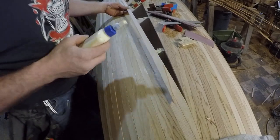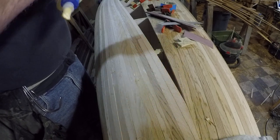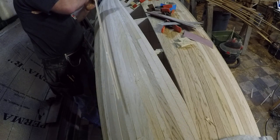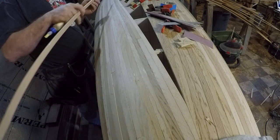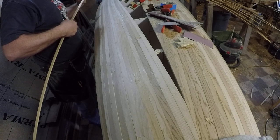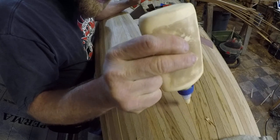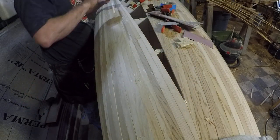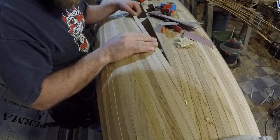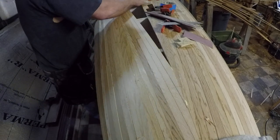Once that's done, all that remains is to glue the piece up and install it permanently. Because the bead and cove fits so nicely it really doesn't require much glue, so I just apply a small bead down the cove as well as some to all the ends where it needs to glue up. I also put just a tiny dab right in the point there, because it often wipes the glue off as you slide it into place and I don't want anything that isn't glued up well. Then slide it back to line up the witness mark and everything gets clamped in place.